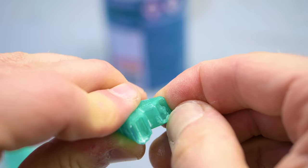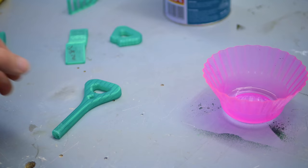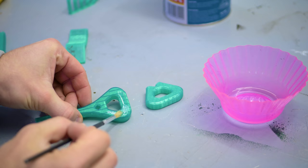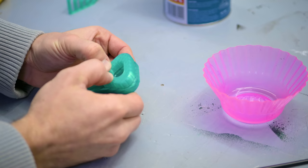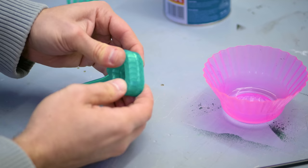But it got me thinking. Before we even get into the acetone vapor smoothing part, I wanted to try out if we could actually solvent-weld two parts of PLA together. The way you do that with ABS — or PLA in this case — is you take both sides, brush some acetone on it, let it dissolve just the surface, and then press those two parts together. It should get tacky and sticky right away, but it takes a few minutes or hours, depending on how much acetone you put on and how big the surface is, to reach its full final strength. So I tried exactly that with two clean surfaces of PLA, pressed them together, and while it was clear they were immediately sticking, I set them aside for now.